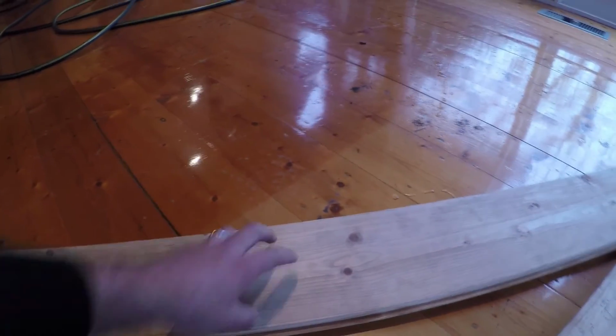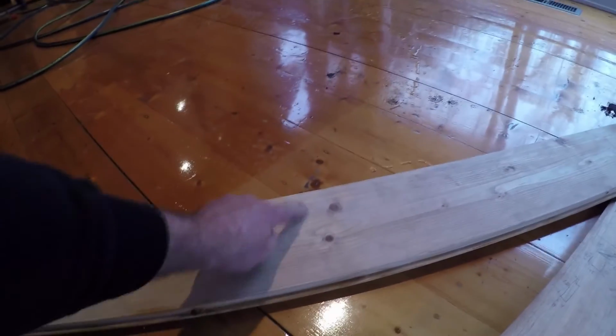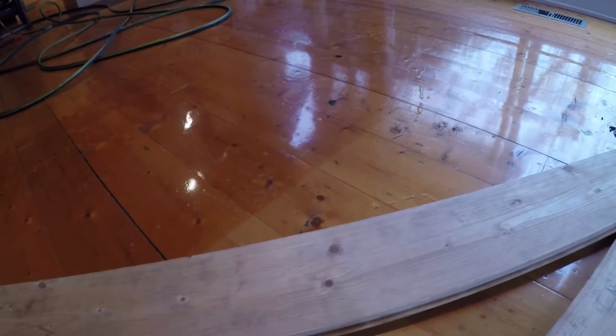I've done a video just on the Baltic pine on new to old. This is about an 80-year-old tree. This is about a 30, maybe 20-year-old tree. Baltic pine's a very soft timber. You can use it inside your houses. You can get very thick boards that are about 25 mil. Stops a lot of echo, it helps a lot. But it's still a very soft board and it dints up. If you have a look here, this is how badly it dints up, and it dints up very quickly as well. Whereas you go for a hardy board like the chestnut, or even better still, the yellow box or the blackbutt, it's a very hardy board, it doesn't dint up very easily.